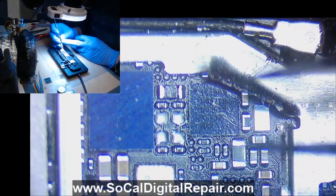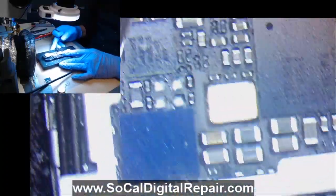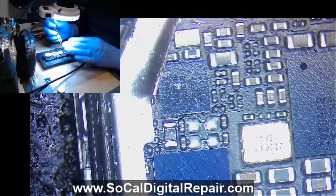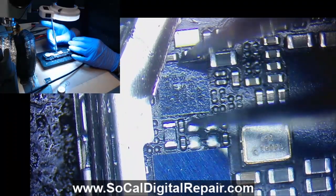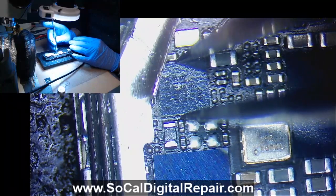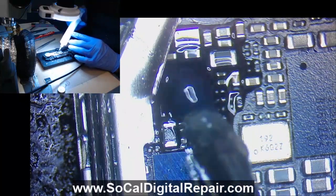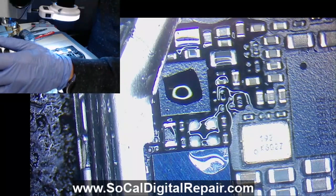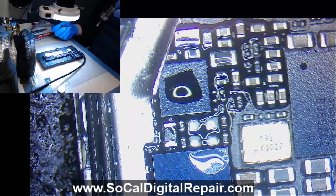The key is to always position the board in a way you can comfortably reach the chip you're trying to grab. Rotate it and see if it's a good angle — for me I grab it here. Put some flux; flux is always necessary. When in doubt, put a lot. I set 365 Celsius, 65 air.